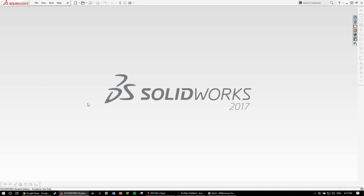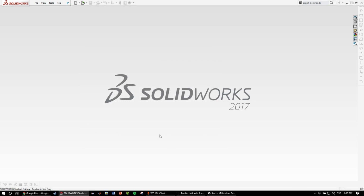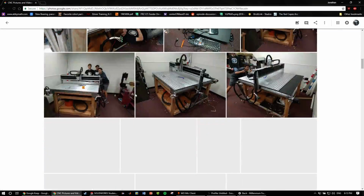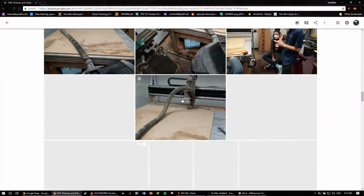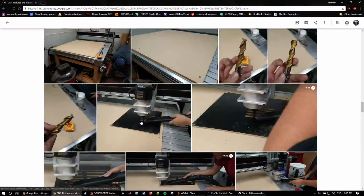In this episode, part 3, we're going to be dealing with the tube jig. Along with sheet metal on our CNC, we created a tube jig, which I will pull up some pictures of, and the tube jig allows us to use the CNC. It puts vises on the CNC and allows us to use the CNC to cut tube as well as sheet metal. So typically it's very difficult to actually mount any sort of tube onto, like, say, the MDF board.